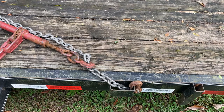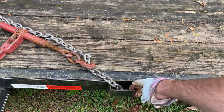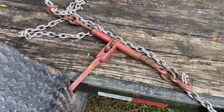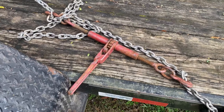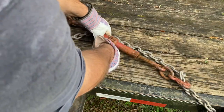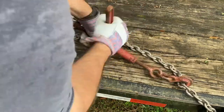Here's another tip: when you're working with chain — and sometimes even cargo straps — if you have an option to come through an attachment point and put the hook so that gravity holds it down, you won't be running back and forth trying to keep your hook from falling out while you're binding it down. Now this is called a ratchet binder. The ratcheting action in the handle lets you keep pulling it together. Basically it's two screws that, as you tighten down, pull the slack out of the chain and keep it snug. I'll tighten this load down — you can hear it ratchet as it tightens.